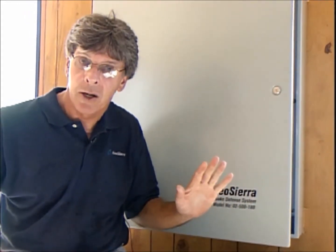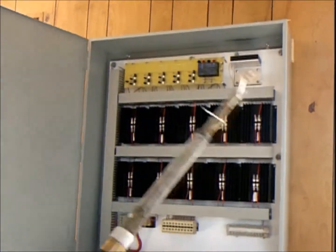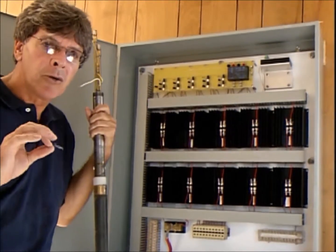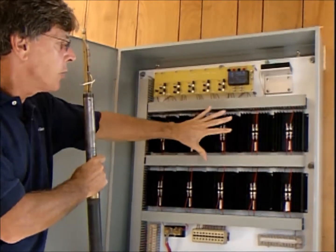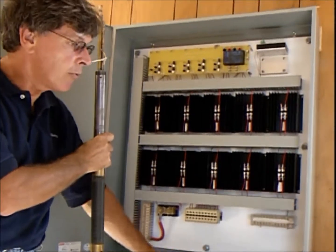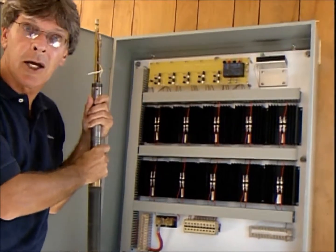And these are connected to a power source. In this case will be a number of batteries, heavy-duty batteries, and connected to this panel. And what this panel has, it has a lot of switching gear, and this is a lot of energy, but it's only applied during the earthquake, so it's only applied for about a minute to 2 minutes. And this switching gear will switch and energize these electrodes in the ground. And this will apply about 200 volts DC and 500 amps, enough to stabilize a fairly large structure.